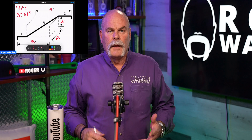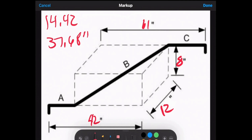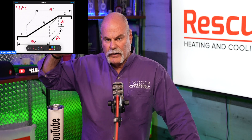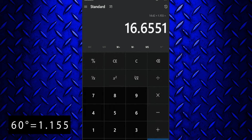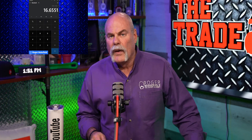Coming back to this drawing, we've got everything we need — we know our rise, our vertical offset. Now that we know this piece, we can also determine our C's and our A's. Plumbing math is pretty easy. We're still using the 8 inch vertical and the 12 inch horizontal. We know that 208 gives a square root of 14.42. Now we're going to take our 14.42 and multiply by 1.155. That gives us 16.65 inches — so if we have a 60 degree offset, our total piece center to center is going to be 16.65 inches.